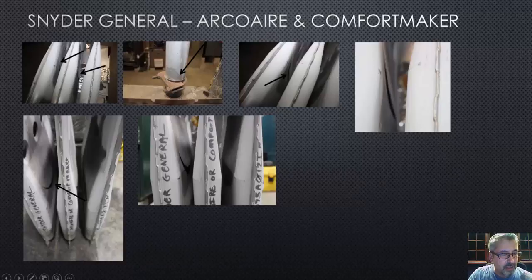This is a back view. I had the heat exchanger laying down and you can see there are some fractures. There's a fracture from that rear view. Here's a zoomed-in view and you can see a pretty large fracture there. And then there's another one and then a zoomed-in view of that.